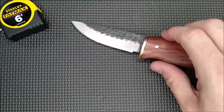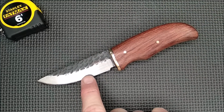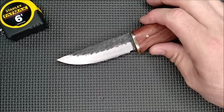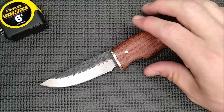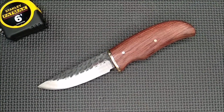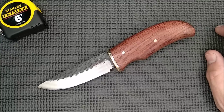The blade depth, did I do the blade depth? Yeah, I did the blade depth. The grind angle on this knife, 20.3 degrees on this side, 24.9 degrees on that side. So not excellent, but quite good hand sharpening that they do at the factory. Almost all knives made these days around the world, even the real expensive ones, are still hand sharpened. Nothing wrong with that, except for the fact that invariably people sharpen one side at a greater angle than the other. It's just the way the human hands work.